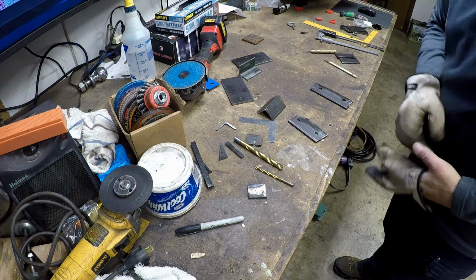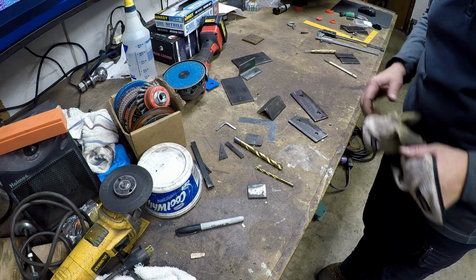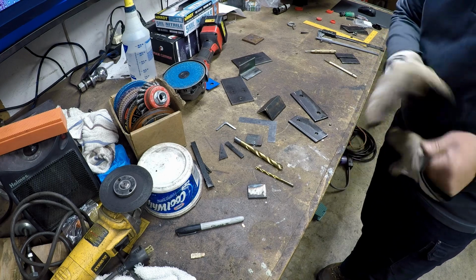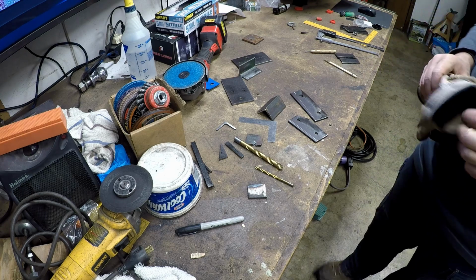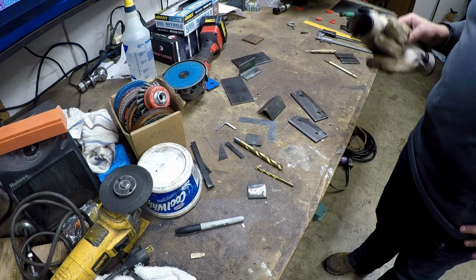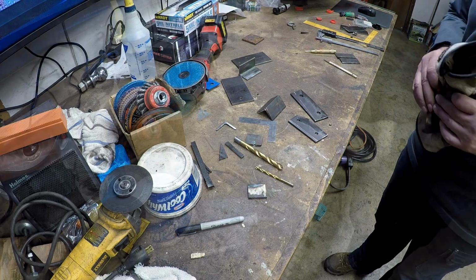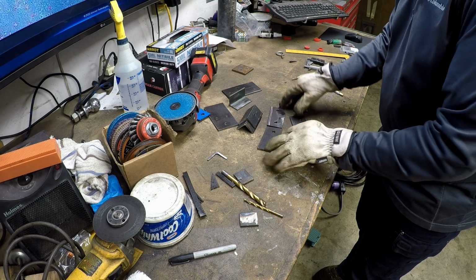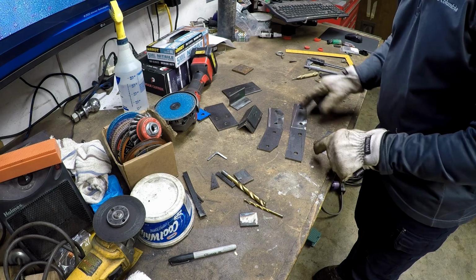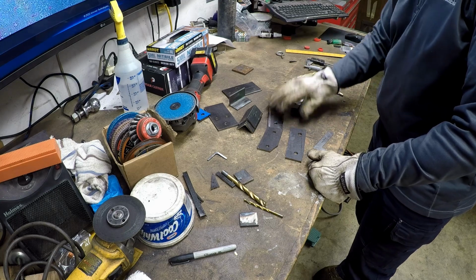And the lines I just wiped out are actually 1.5 inches from this scribed line, so I can just remake them with paint or whatever. I just wanted them scribed at that time for measurement and mock-up. So now I'm ready to weld these first couple of plates together. And then actually I have to transfer these lines to the other plates, to the second set, and then I'll weld them all together. I've marked them in the mirror image of the other side. So we should be able to grind these off, reset the weld points. I'll just paint a line and then weld the brackets on.